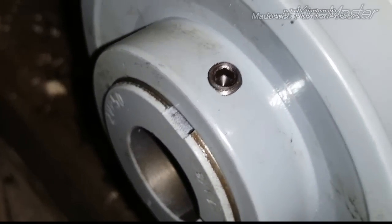So we're going to go ahead and lock those in. When we take an amperage reading, we'll know whether we need to open it or close it anymore. It's got to be lined up with this little hole. See this little slot? It's got to be lined up right there. That's what locks it in place. We're going to go ahead and lock those in.